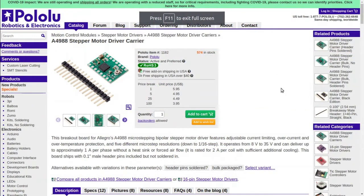These are the specs for the actual stepper driver itself — it's the A4988 stepper driver. Your stepper driver may be made by a different company, but they're all relatively the same. Normally it's the sense resistor on there that has a different rating on different boards, so we have to use that in our calculations.